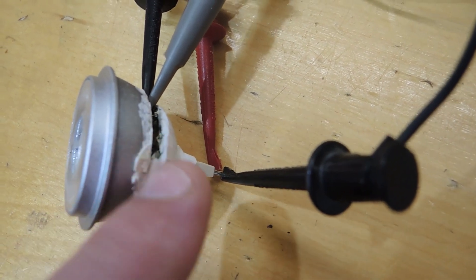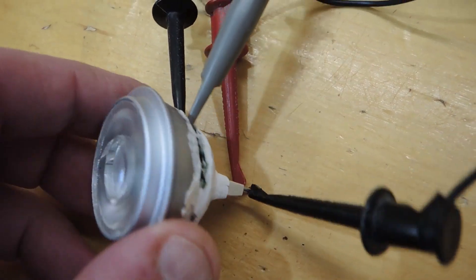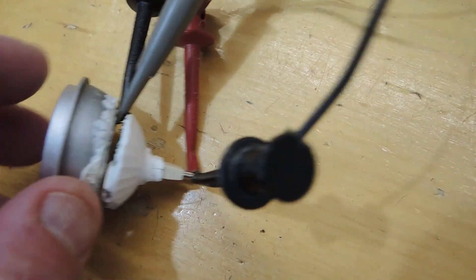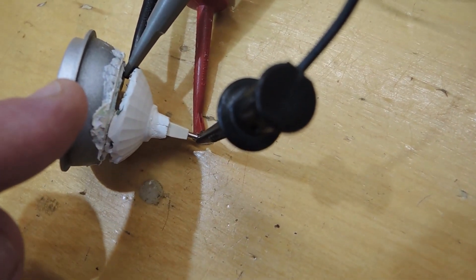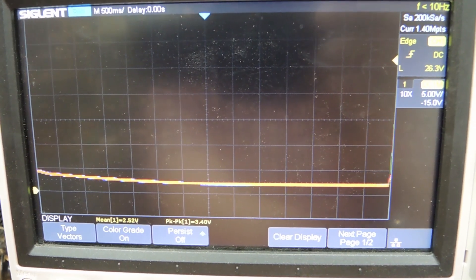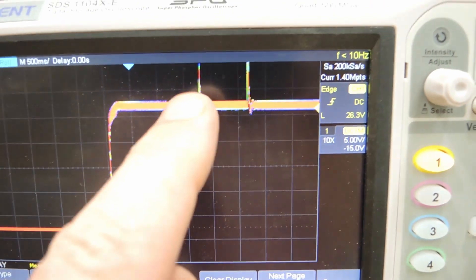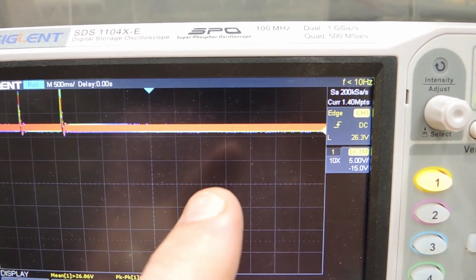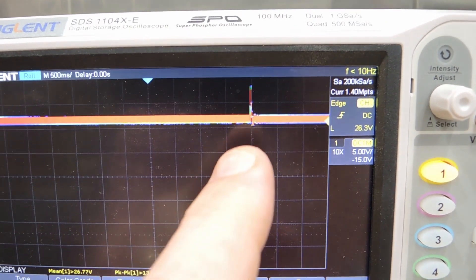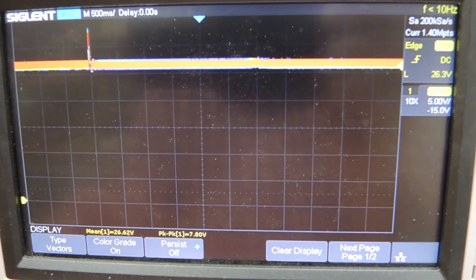To sort out what's going on, I've removed the glass envelope. I have it connected to a 12 volt power supply, and I have an oscilloscope connected to the output of the power supply — which is in the white base — to the LED array. Here's a normal power on where the voltage rises. Here are the failures: the light is flickering below and it gets into a mode where the power supply starts to become unstable. The bulb flickers, and of course it was taken out of service because that wasn't very desirable.